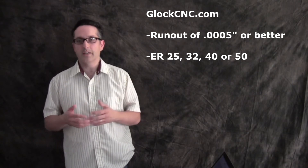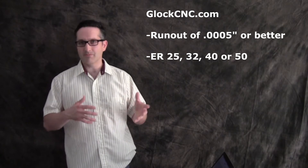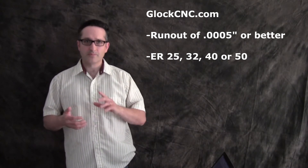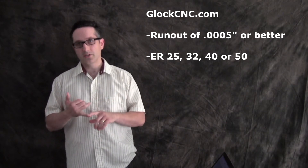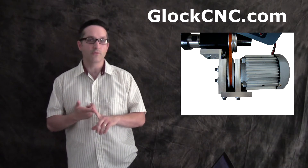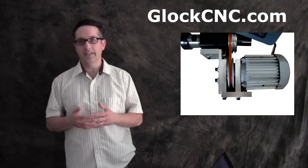We wanted to move it from a hobbyist-quality piece to a genuinely precision instrument for making these parts. So we developed the ER headstock. We also needed more power than the 240-ish-watt motor that comes from SureLine, so for our commercial setup we used a 600-watt industrial continuous-duty motor. Options of 800-watt, 1,000-watt, or 1,400-watt are all now available for the SureLine headstocks.